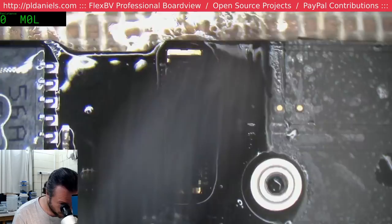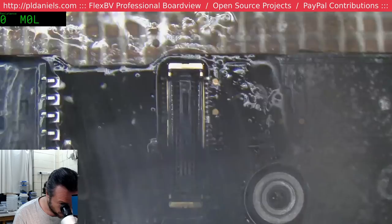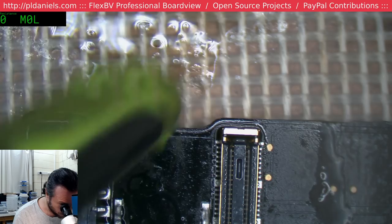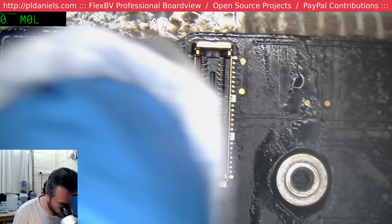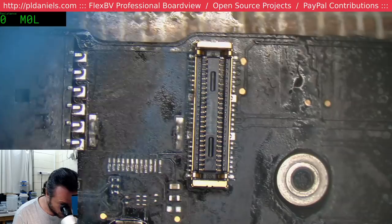If you do start working on these machines, for the love of goodness, do not pull on the camera cable. Always lever the thing out with the tips of your spudgers or something. Do not grab onto that cable and yank. You might get away with it a few times, but at some point, if you keep up that behavior, you're going to pull it clean off, and then you'll cry a lot.